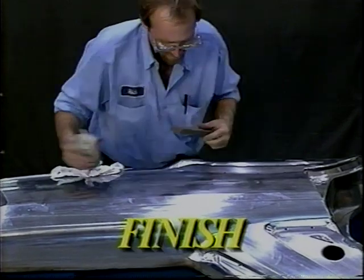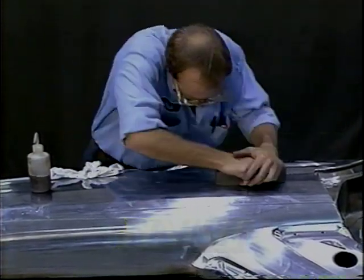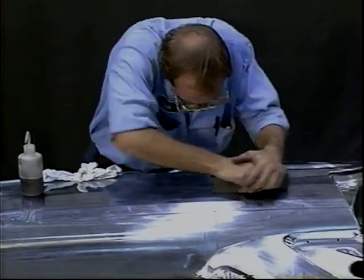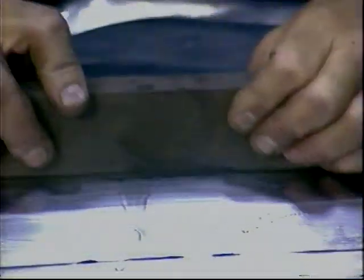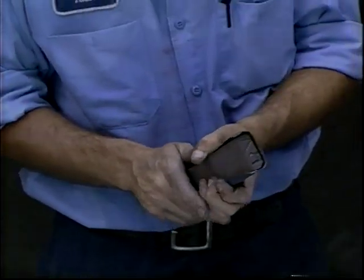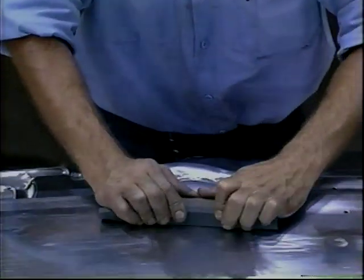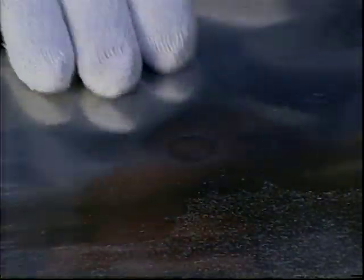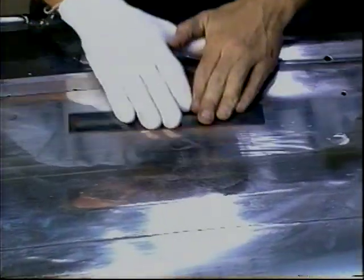Finish the surface flush with the rest of the die surface. For best results, we recommend a 500 grit special chrome repair cherry oil stone. Remember to avoid stoning the undamaged die surface. Then polish with a 600 grit emery paper or a 15 micron sheet. Be sure to clean the surface, hand check the weld and scale to assure no highs or lows exist.